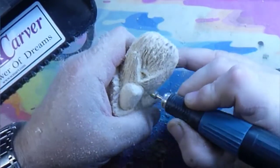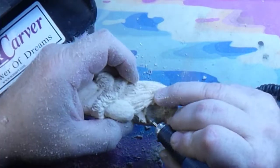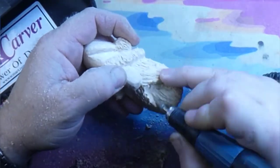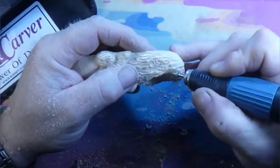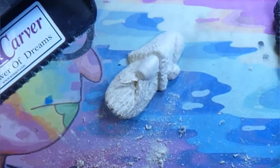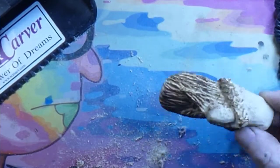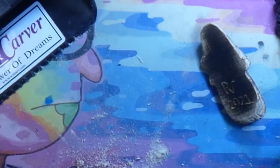There's only one way I found to get rid of all the fuzz. This lot of basswood I got is particularly fuzzy — I don't think I've ever had basswood fuzz up this bad. Somebody told me you can put it in a 50-50 mixture of isopropyl alcohol and water and it will soften the wood and cut down on the fuzziness. But the only way I found to get rid of the fuzzies is to hit it with a torch and burn them back — of course you are going to lose some detail. Little handheld butane torch. Might as well go ahead and make the back black and burn your name in.